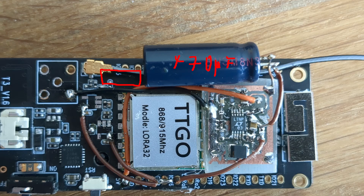Sometimes when they start up they make some load spikes, and then it goes into the boot loop. The capacitor helps even more, because sometimes it still did a funny boot loop, but much less. With the electrolytic capacitor connected to it, it was really steady.